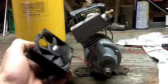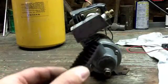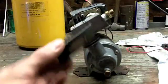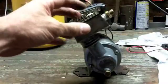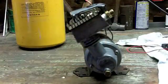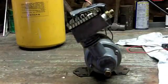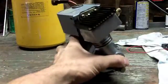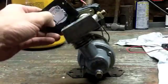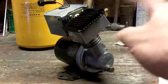I said I could improve on this — so I found an aluminum heat sink that came off a computer processor. I figured I could set it on top, drill a little hole into the head and tap it, screw that sucker on, and it would act as cooling fins. Heat transfers from aluminum to aluminum no problem. If I really wanted to get fancy I could use that thermal grease — I don't know what it's called, not being a computer nerd — that helps conduct heat. I'd drill a little hole to accommodate the intake port of the cylinder head, and we'd be good.